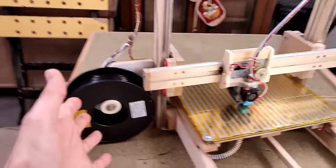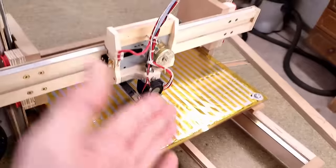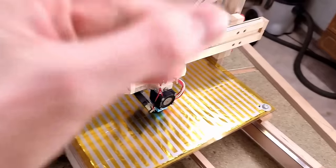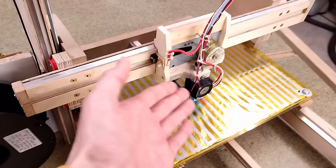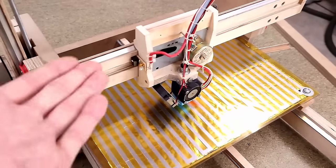Okay, so to double check my claims here, I set it to quarter step mode as opposed to the half steps I was running before, and something very interesting I hadn't considered popped up. Microstepping doesn't flat out not work at all on these motors, but it does kind of work a little bit at higher speeds, smoothing out motion, as you can hear from it not being as loud anymore. Which perfectly lines up with my explanation of why microstepping works in the first place.